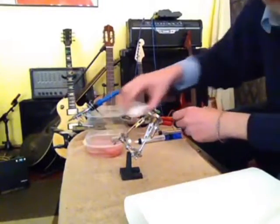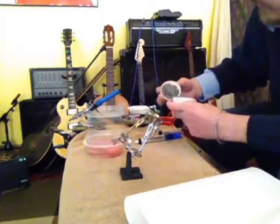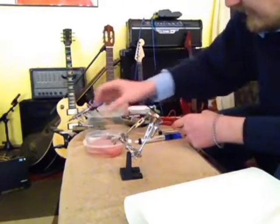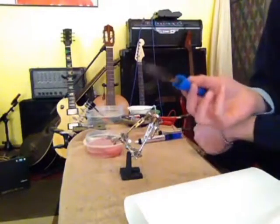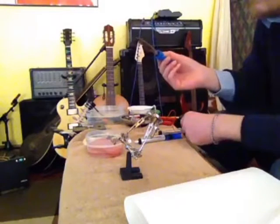Alright, I'm going to show you how to tin your soldering iron to prepare for a good solder job. We're going to want a nice clean soldering tip that is tinned, and what that means is as it heats up, you get it nice and hot. You see how mine was left nice and shiny there on the top? That's what tinning is going to do.